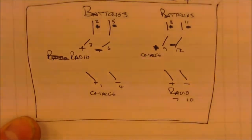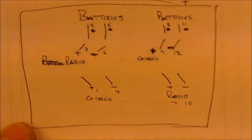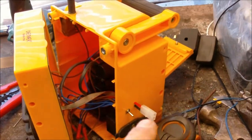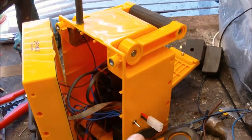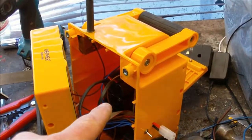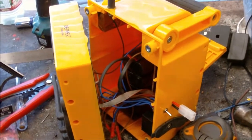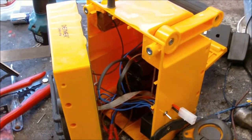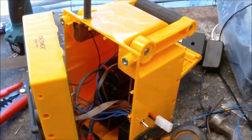It's quite simple — you don't really need to be in electronics or electrical, though it does help because you can understand the currents. Total cost for the battery pack, the switch, the Tamiya connector blocks, and my charger — which is a fast charger or trickle charger specially designed for nickel metal hydride batteries — is £43. When you think that a Makita battery is around £50, I've got longer battery lifetime, it's cheaper, and I've got two battery packs for the price of one.